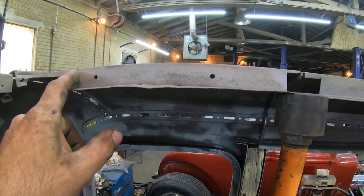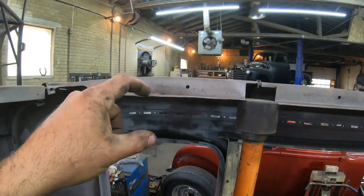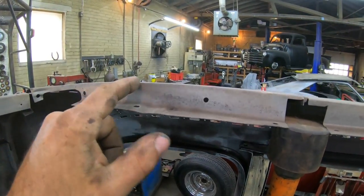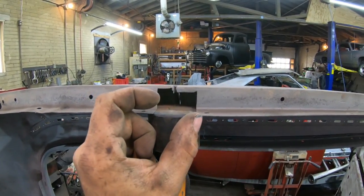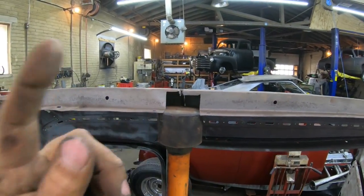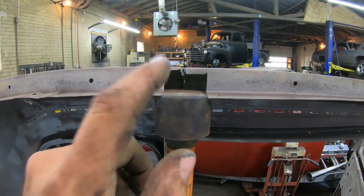You can kind of see the arch is in the sheet metal here, and this is actually pretty strong the way this return is on the roof. That shape is still in there. There's no damage to it. It just sinks down here because there was a larger wooden bow for structure across the car behind us over to here, and that's why I'm actually sagging at this point.